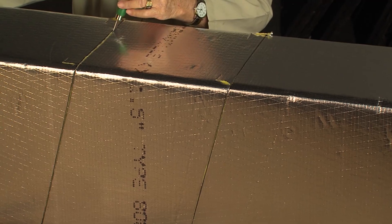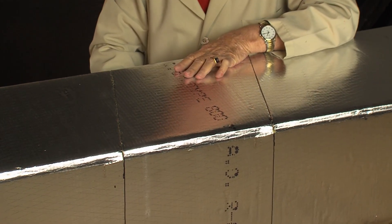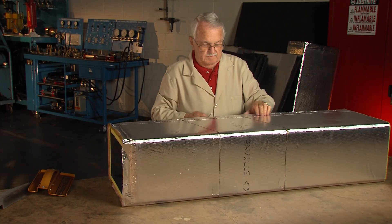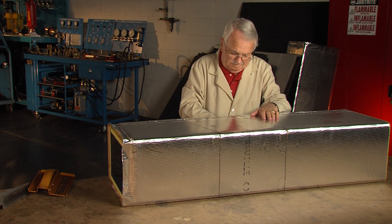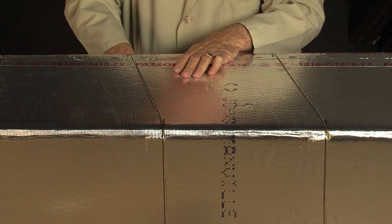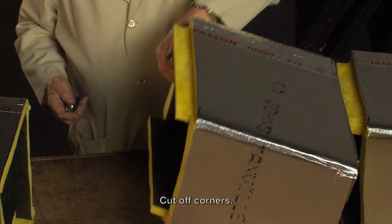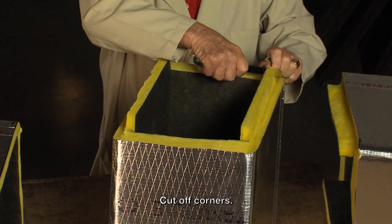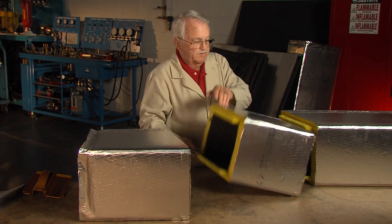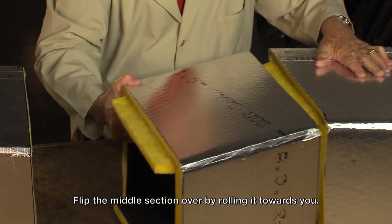As I cut down, notice that knife is not at 90 degrees straight up and down — it's on that same miter, that 15 degrees again. I put the knife out there to set my hand for that 15 degrees, then come back and go underneath it and pull it apart. I pop these corners off before putting the duct together, because I'm going to flip this piece of duct over and then all I have to do is shove these back together.